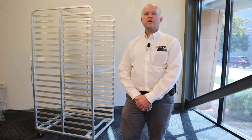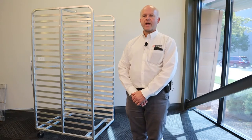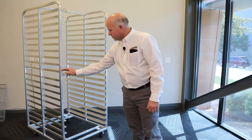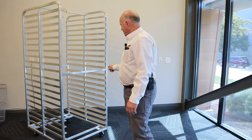The reason I like to speak about conventional racks is they are opposed to nesting type design — in our case, Shopcraft. Typically conventional racks are stronger than nesting racks because of the tie points. Those tie points are at the corner here, at the bottom, at the top, on the sides.